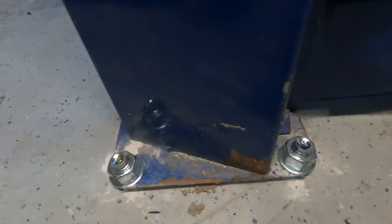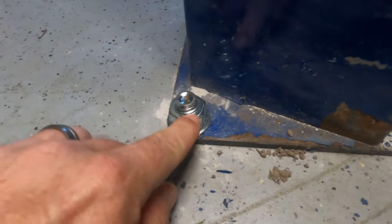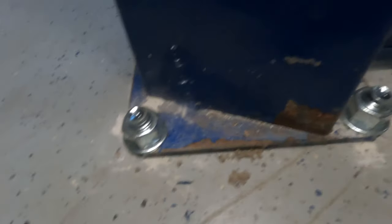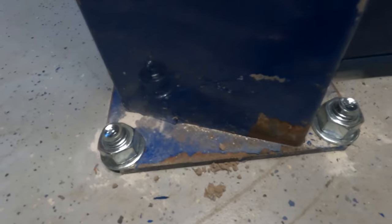Follow the instructions. For the most part there's not much sticking out — everything is torqued to spec. The wedge anchors came with washers. I took a hammer, put the anchor down in the hole, and tapped the top — sometimes five, six, or eight taps and it was down. Then I used a standard three-quarter ratchet to tighten them all down first, four on each. Then I went back with a torque wrench set to 90, which calls for 85 to 95. I backed it down to 85 and then went back to 90 — basically right in the middle.